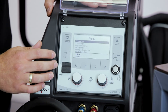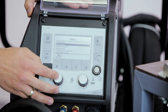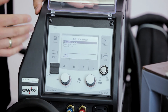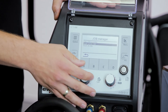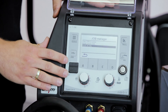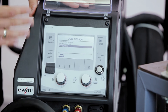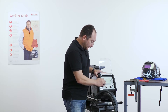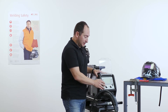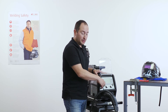In the menu of the welding machine, we also have the job manager, where we can copy jobs from one position to another, reset the current job, or even reset all jobs if we have problems with the welding and cannot identify which parameters are causing issues. In the program sequence, we reach exactly the same parameters seen previously, hidden as a shortcut behind the A button.